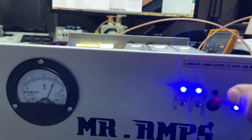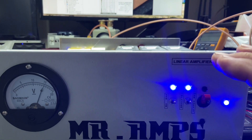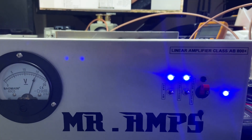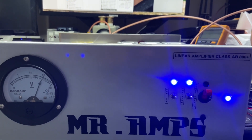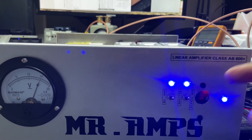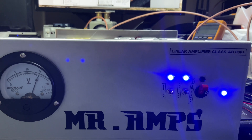This particular amplifier, when you're talking about Class AB1, you're keeping your transistors at the best curve level to obtain your classification of amplification. When you reach that point, your transistor is going to run hotter. That's the reason why I use fans with a lot of RPMs and CFMs — because you want to keep the components at room temperature if possible.